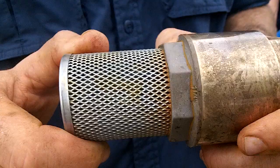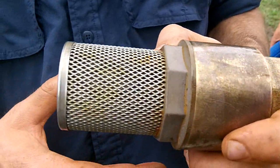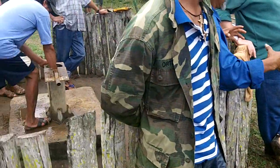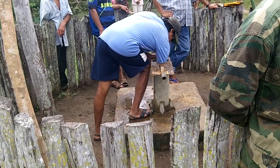We're actually seeing that there's not a lot of casing when they first drill them. They might use the bentonite to coat the sides of the well, and then they're putting casing down about six feet and then not the rest of the well. So part of a problem on this particular pump is that the mud is possibly falling in and making the water fill up more slowly.